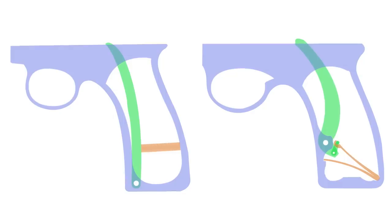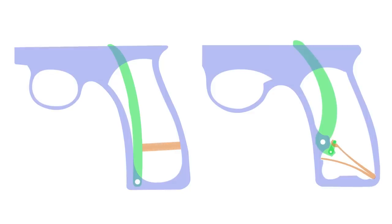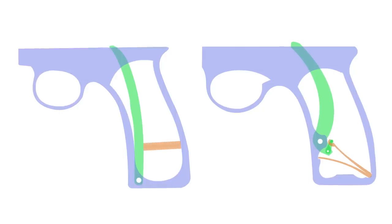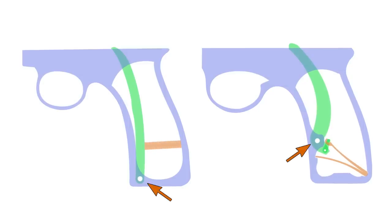Now, the .38 caliber would use a V-spring. We've actually seen this system before, as it would be used on the later Webley self-loading pistol for which we have an episode. Its inclusion on the Fosbery eliminated the hinged backstrap in favor of removable side plates for easier servicing. It's also worth noting the shift in that pivot point.